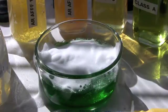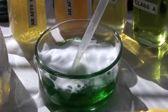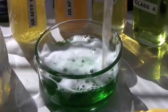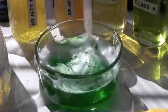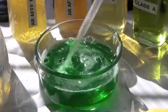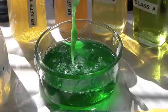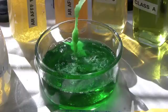What's going on now is the thick material in the foam concentrate is turning into a polymeric mass underneath the foam blanket. The foam blanket rides on the polymer, and that's what disconnects the alcohol from the water in the foam blanket. If I plunge it, it destroys the foam — and that's just what I'm doing now. Now the only thing left is the polymer, which is the material that precipitates out of the foam blanket that allows the foam to ride on it.